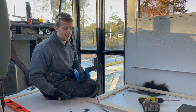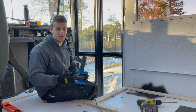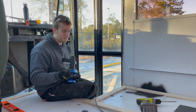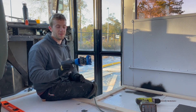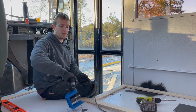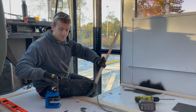In case you're not familiar with it, this is a Kreg Jig. This is an awesome version where you can take it to go — it's really easy to use. It creates pocket holes so that you can join two pieces of wood together. The holes are kind of hidden but they make really strong, great joints. I think this is the 520 model. It's super great because you can adjust the handle, put it on a table, put it vertical — whatever — and it clamps your piece down.